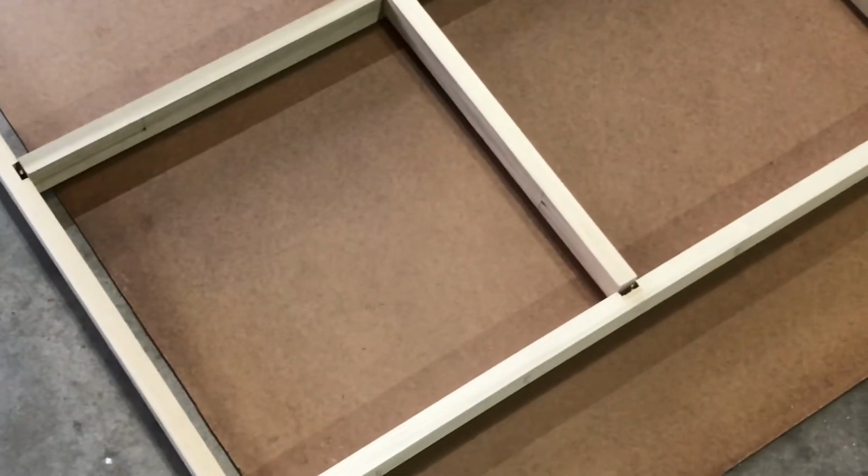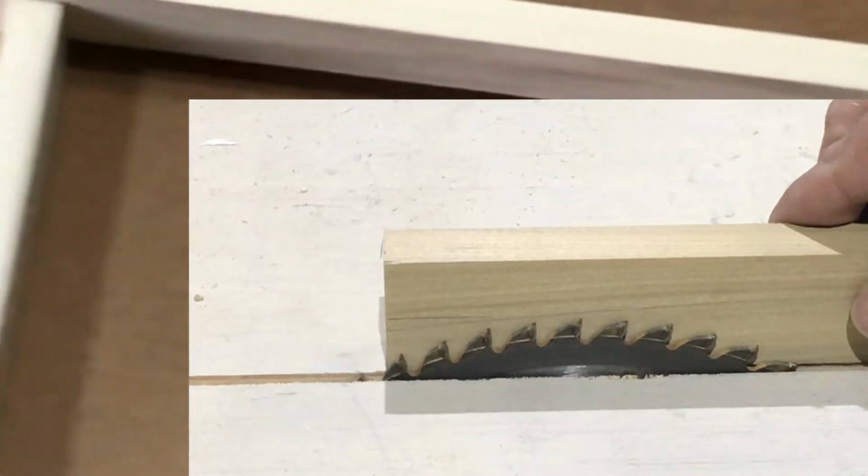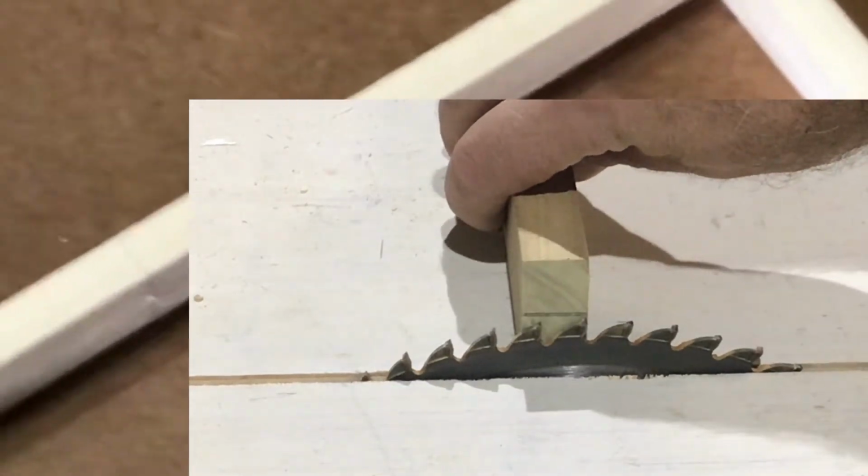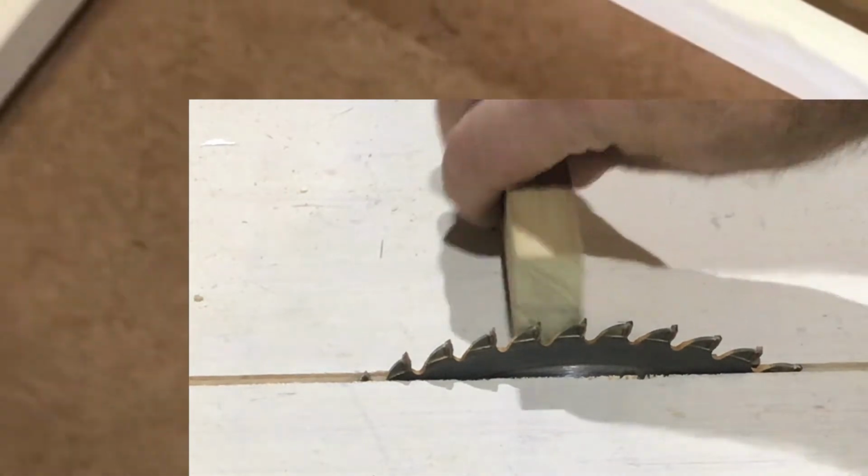Do you remember earlier, in part 1, when I said my cross-bracing half-lap joints didn't quite fit, and I had to take the pieces back to the table saw to remove a little more material? It turns out the scrap I used to set the dado blade height had a slight size discrepancy of about 1/16 of an inch to the stock being used. When I went to dry fit all the parts together, I noticed the half-lap joints weren't even close. I figured out the problem, then took an additional 1/16 inch out from all the cross bracing. After that, the fit was perfect.